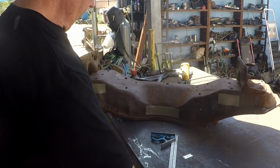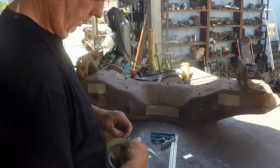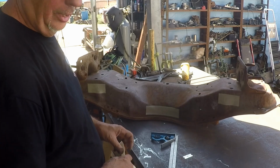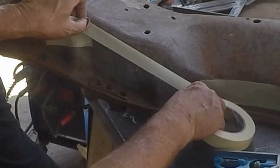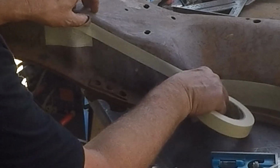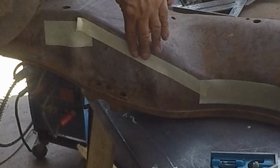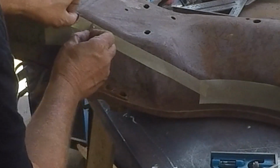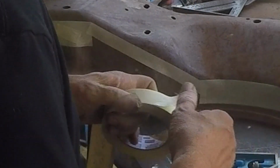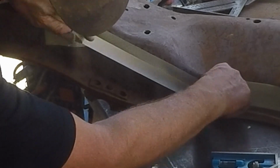So with all this accuracy we're trying to do, bottom line, most of it doesn't matter because the rule of thumb with a MIG welder is, if your gap is small enough that you can step over it, you can close it up with a MIG welder. All right, so we're gonna go right from this point, right there, down to this point, right there. And it should be fairly straight. And we're gonna go right down here. Do the same exact thing.